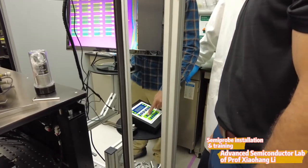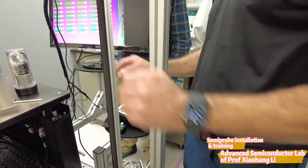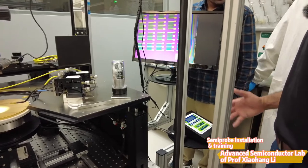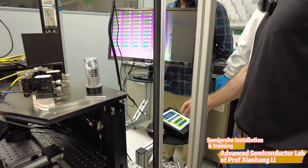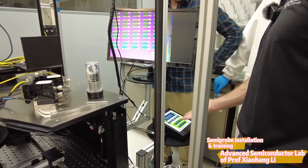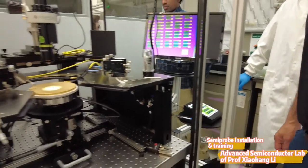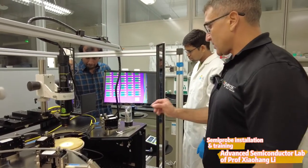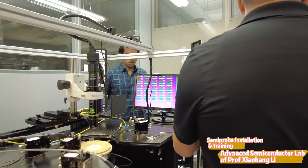The A and B option is for illumination — you don't have that here. Usually it goes through to the actual light and is also controlled. Microscope companies are giving fewer and fewer options now — before you could adjust light and zoom together with one button. With this one, we have a separate interface for that. That's pretty much the system mechanically. The microscope here has a 2x objective — you can also put a 10x objective if you want even more zoom. The more zoom you get, the lower the working distance.